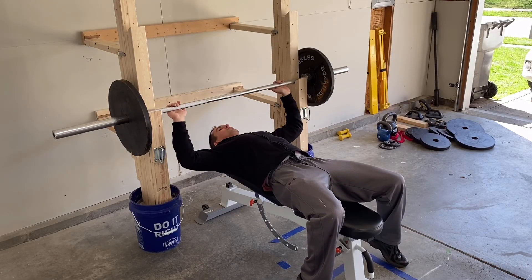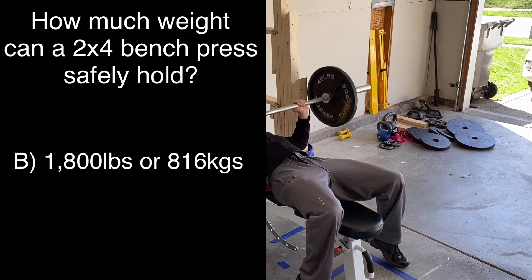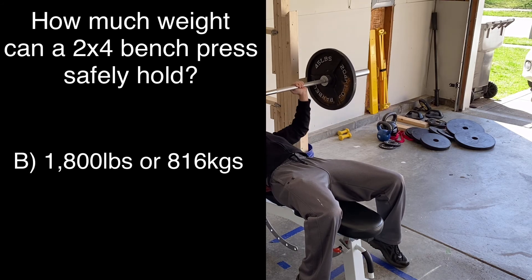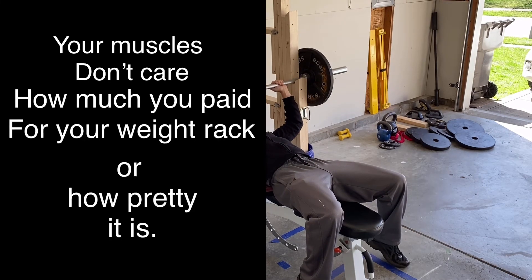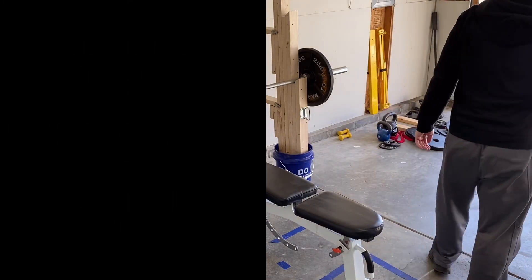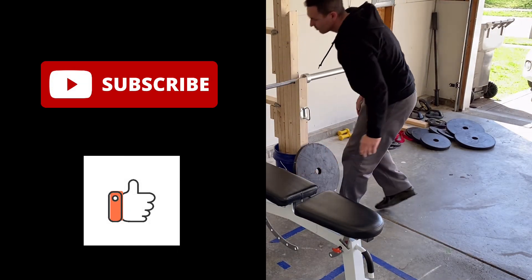In our fifth and final step, we apply a three-fold safety factor. The barbell will be held by two 36-inch posts that can each hold around 2,700 pounds. We divide that by three — we never want to load our bench press post with more than one-third of the maximum weight predicted by allowable stress design. Circling back to the opening question: if you chose 1,800 pounds, you win. Your prize is the confidence to build a wooden rack that will build you, and you get to save a bundle of money. Your muscles don't care how much you paid for your weight rack. Please drop a like or subscribe if you'd like to see more content about equipping people to strength train from home.